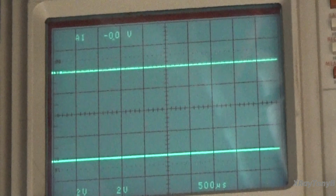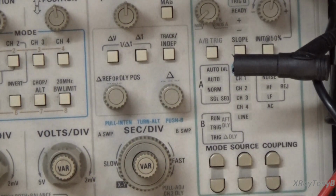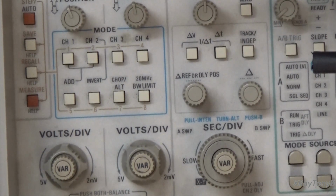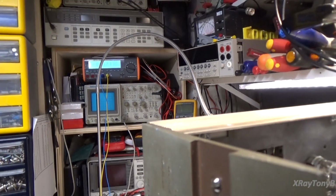Well, I looked at my tone controls and noticed that bass and treble were not set flat. Now, by turning the bass and treble up, all of the components in the bass and treble controls influence that square wave and cause it to distort like that. So, two things that tells me. Number one, the tone control influences the circuit. But number two, chances are that's the one part of the amp that I have not done yet. I've not refurbished or restored or changed or modified.